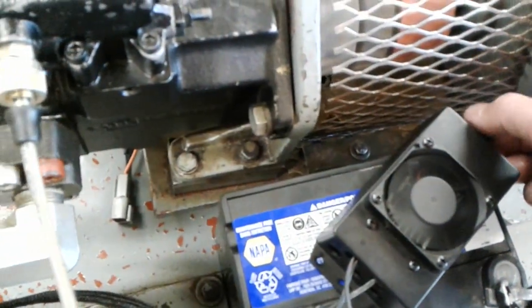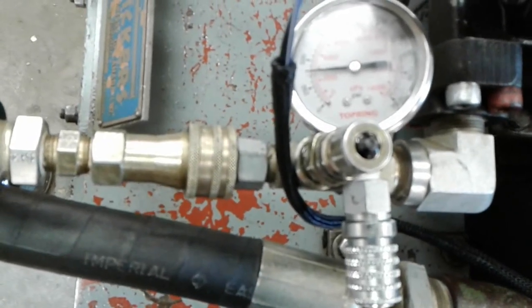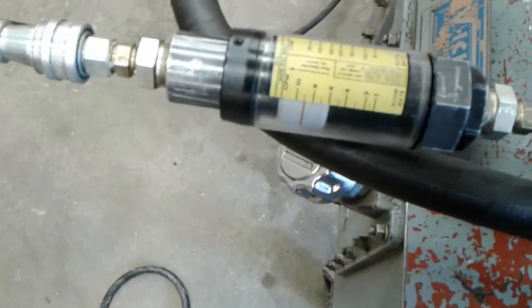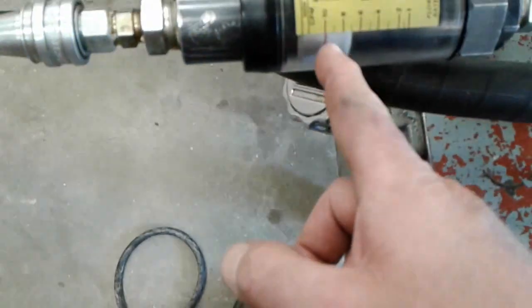And again, I'm just decreasing the current to change the load sense pressure, and I bring it up to 350, 400 psi load sense signal. And now I've got about 9 gallons per minute flowing. And my motor speed's doing pretty good now. The motor shaft's whizzing around there pretty good. Bring it up to 500. This 500 load sense signal, and again, that's just being bled through from the pump outlet to the load sense port. And now I'm right up to 10 gallons per minute.